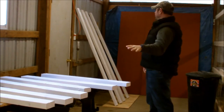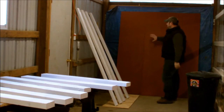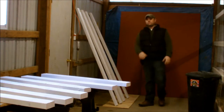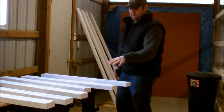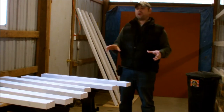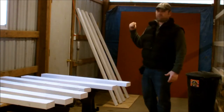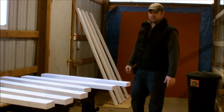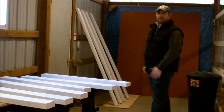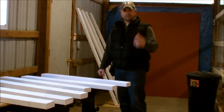Quick update on where I'm at so far: I cut all my trim. I'm going to use two-by-fours for the trim around the outside of the door. I cut down the doors already and have three coats of red paint on them. On the trim pieces I already cut, I put a coat of sealer primer because these are going to be outdoor and exposed. That doorway takes a lot of wind, rain, and snow so I want as much weatherproofing as I can on the door.